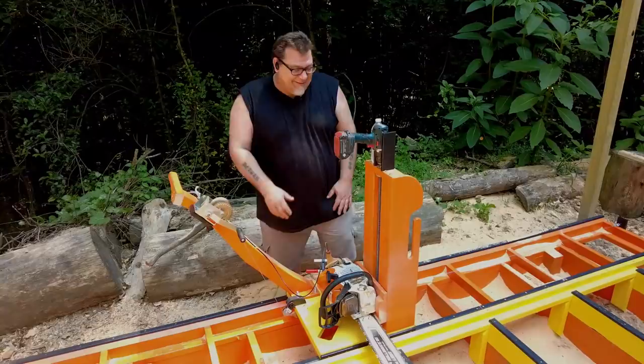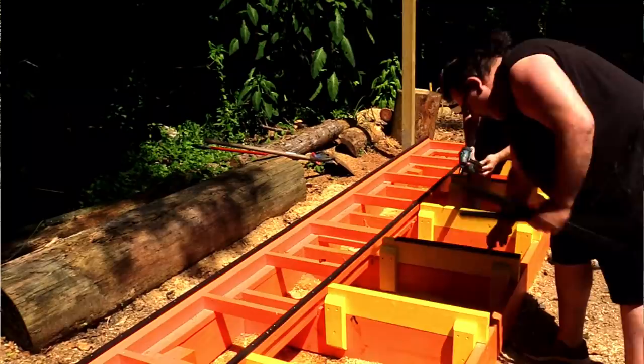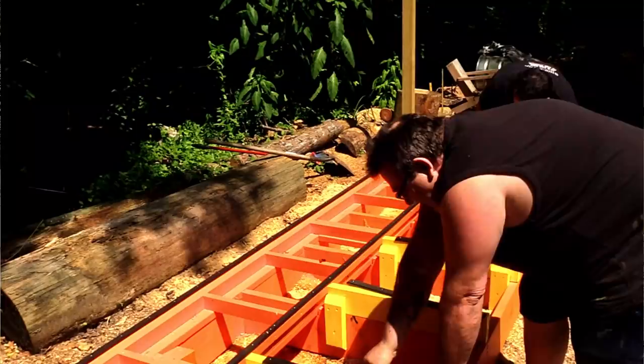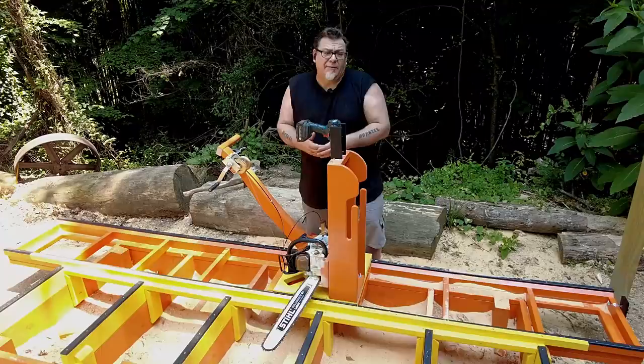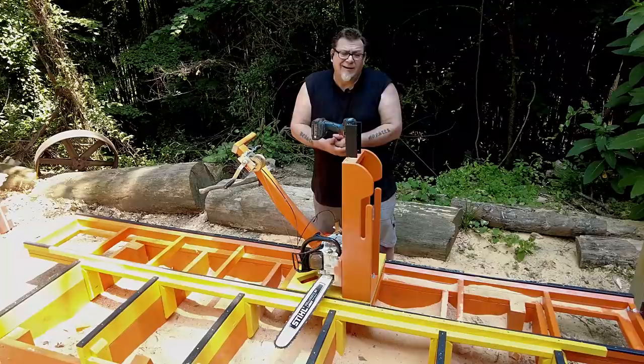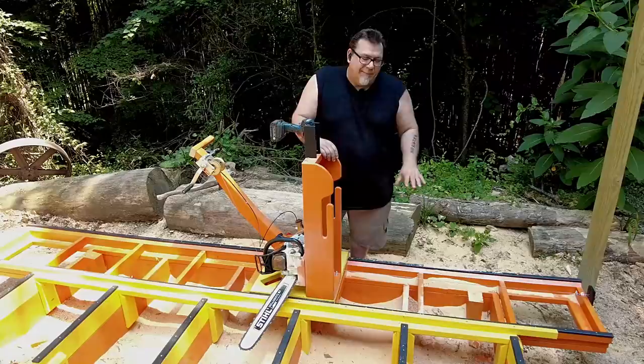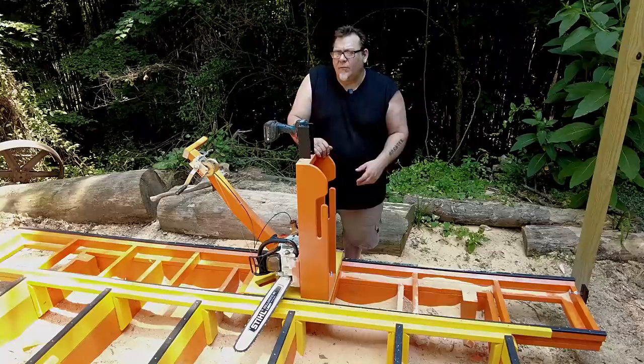Some other significant changes: I put HDPE on top of the track and on top of the log mount. It's not super necessary — just painting it and keeping it waxed would be plenty good — but I have a lot of HDPE scrap laying around, so we used it. Other readily accessible options that would work pretty well are cabinet countertop laminate material, which is very smooth. The concern with that is it's usually applied with glue or contact cement, and in summer heat you might lose adhesiveness. PVC plastics, HDPEs — any of those things would work if you wanted to go through the trouble.